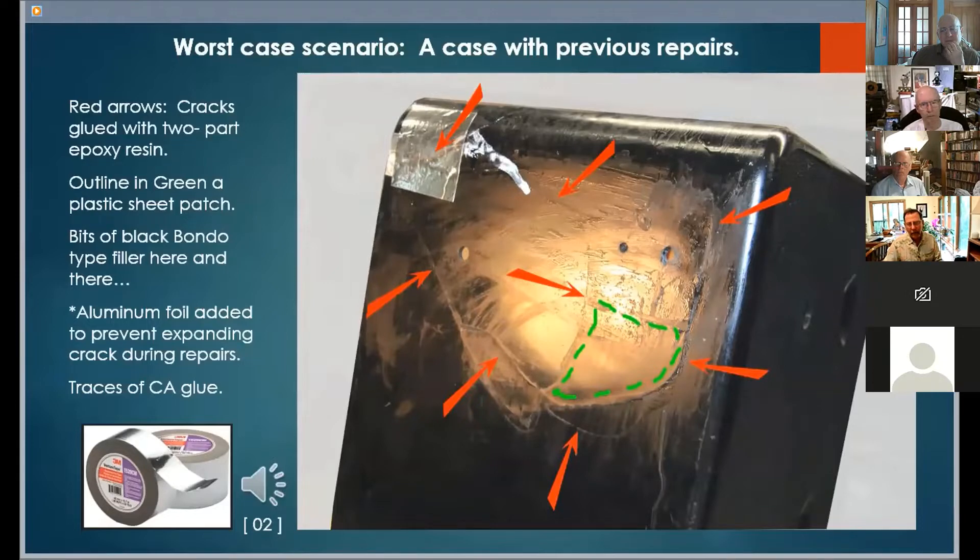The smears you see are epoxy residue. One way to remove it is to lay scrap cloth over the surface and saturate with acetone lacquer thinner. Lay a couple of sheets of plastic wrap over the soaked cotton, then lay a piece of cotton terry cloth on top, followed by a sheet of scrap MDF shelving or any other material to provide a weighted cushion to keep the solvent against the old adhesive. Be patient — an overnight wait would be ideal. Then remove the softened epoxy with a plastic scraper and rags soaked with more solvent.